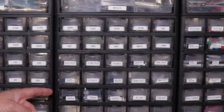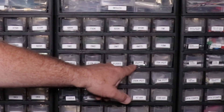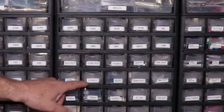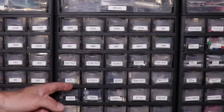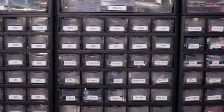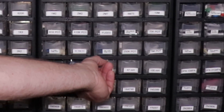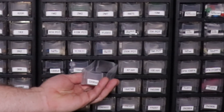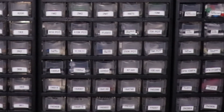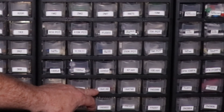After the fixed resistors come variable resistors. I have a series of pots: A10K, B1K, 10K linear pots, 25K pots, and a couple of trim pots. I know I'm going to be purchasing more pots and filling out this area as time goes by because they're very useful. Below that is a little bit of random stuff: a couple of very high-value capacitors — some 2,200 microfarad capacitors used for power supplies — then a couple of inductors, and a whole series of diodes: 1N914, 1N4007, 1N4148, all purchased from eBay in a bulk order.